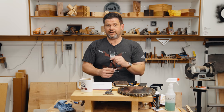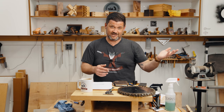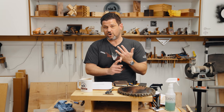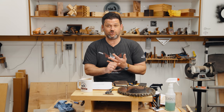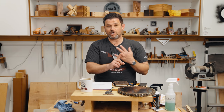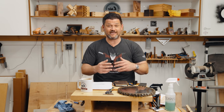Because of the huge amount of carbide on there, there are going to be 10 to 15 sharpenings per blade. If it takes me a year between sharpenings, that's over a decade of use. When you look at the $17.50 average cost per sharpening, the rip blade comes out to $19.96 per use at an average of 13 sharpenings — so that's 14 uses. General purpose is $20.39 and crosscut is $21. That's almost $10 less per use than a mid-grade blade.